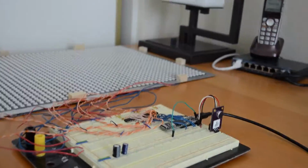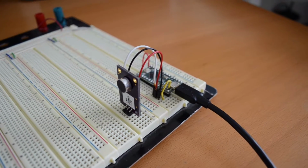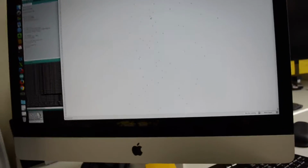other components. So now I have it hooked up to a Teensy LC, exact same pins, and I just made one small change to the code. I'm basically just printing out the raw value, and this is what it looks like now when I'm quiet. Still not a perfectly straight line, but the mic's really sensitive. I will give it that.